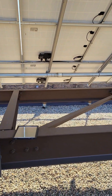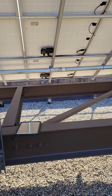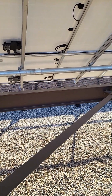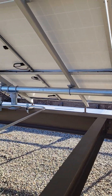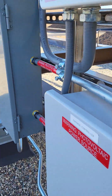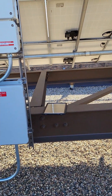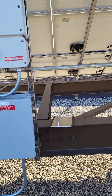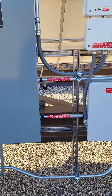For those who don't know the difference: the microinverters on the bottom panels actually convert DC solar power to AC line voltage power. All those inverters are tied together with what Enphase calls a Q cable — it plugs them all together, and from there the wires go through this conduit right back into the electrical panel. It's a pretty simple system. There are more intricate Enphase systems with combiner boxes if you have more zones of panels, but this is pretty basic.